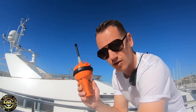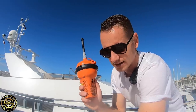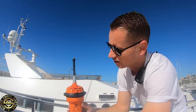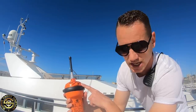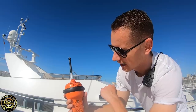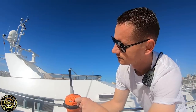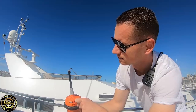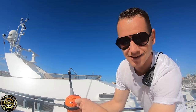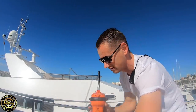It's now exactly 9 a.m., so we're going to do the test on the EPIRB. As mentioned, always test within the first five minutes of each hour. I've got the switch here — I'm going to switch it over and hold it for 15 seconds. I should get one flash, which tells me it's operational. There's the flash — test is good, positive and operational. This equipment can save lives.